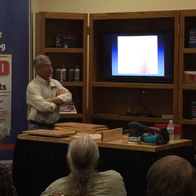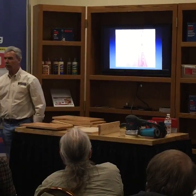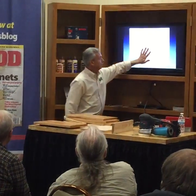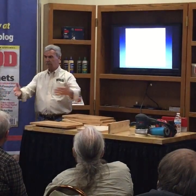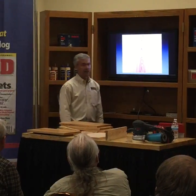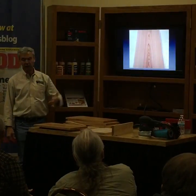So anyway, there's one glue-up that's kind of odd. Here's one that looks on its surface to be odd. Here's some of that straighter grain, and here's some of this cathedral look on the side. Most of you would never put anything together like that. But think of maybe two nightstands on either side of the bed, and these two nightstands have mirror images made up this way that actually make your eye go towards the bed. They have a little bit of look to it. This is the same kind of thing with a change to it, but it's a lot more normal, if you will. Or the cathedral's in the middle, and these two outside edges here are straight. This to me would be the perfect thing for doors.